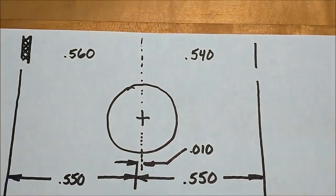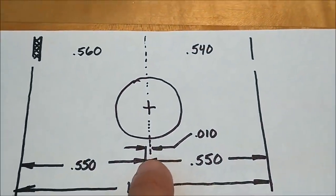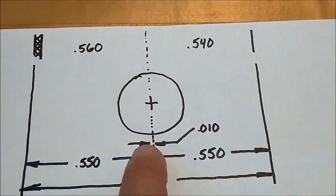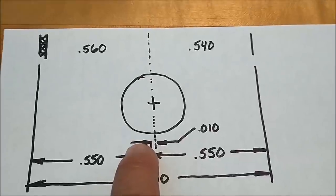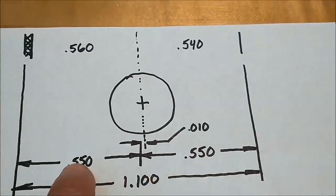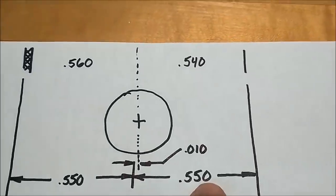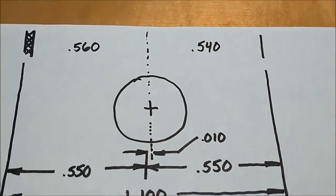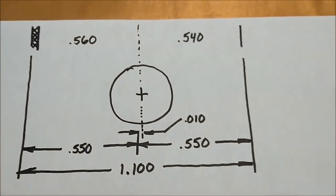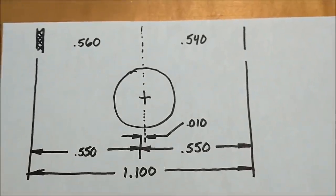The pin lined up with the boss on the casting is 10 thousandths off center, because if you take 10 away from true center, there it is, 540. Give it back, 10 on the other side, 560. Or actually, when you take the 10 away from this one it becomes 560. It just walks over. So as this one grows, this one shrinks. 10 thousandths error. Not bad for a rough casting, and I am quite okay with that, provided the dovetails or the grooves I'm about to cut don't break the edges out. But the chamfer is the working surface, so by all means, have at it.